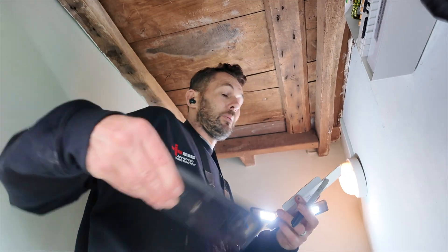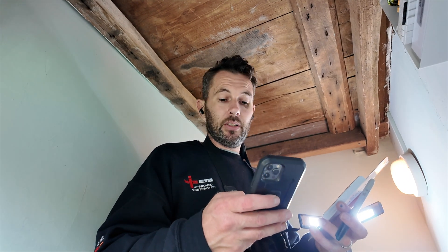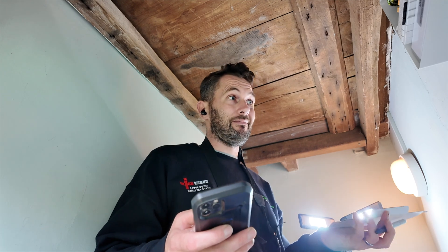So to calculate your ZS — get your calculator out. We had our ZE of 0.23, then you add on your R1 plus R2 of 0.08, which gives you 0.31. So that is my calculated ZS for that circuit. A bit of maths from me — a bit mad.